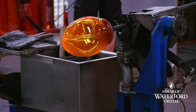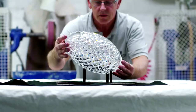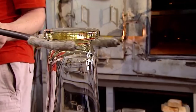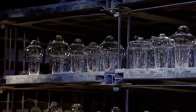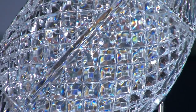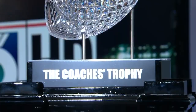Once the ball has reached the right shape and smoothness, the glassblower lets it reach the cooling stage. This is straightforward, but even here the slightest mistake can lead to a mishap — or worse, a football that might explode unprompted later on. After allowing the glass to cool in the air just enough to hold its shape, it is immediately put into an oven kept at a controlled temperature. This oven allows the glass to come down to temperature slowly rather than quickly, which is necessary to ensure the crystal takes its proper microscopic structure. Once the cooling process is complete and the glass has set into its ideal shape, it moves on to the next step.